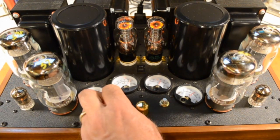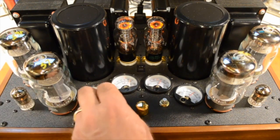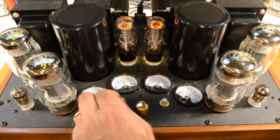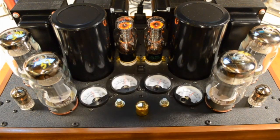It's close enough that you're not going to notice such a small difference. When the difference isn't small, it becomes quite apparent on the meters, and that's an indication that you should get a better set of tubes. Because if the tubes don't match, the power output is going to be limited by the weaker tube in the pair.